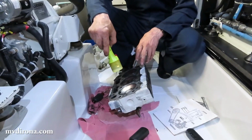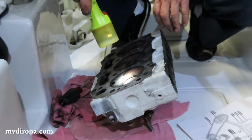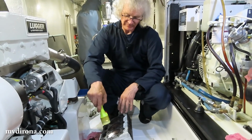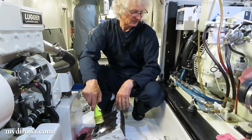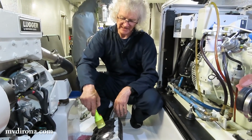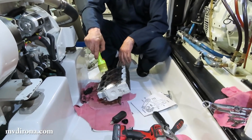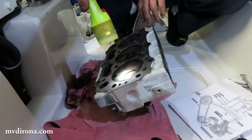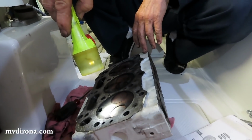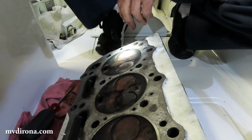Yep. And so I think the lesson there is in situations where the boat's been way over on the side or in horrendous tough weather, the answer is to make sure that the generator has been run after any of those events. It's easy to do. It doesn't take any time, and it might have saved this valve seat from failure, because it really shows evidence of potential water intrusion. And you were saying that the other one or two looked like it might have some potential problems too?